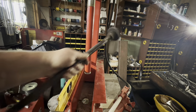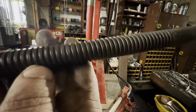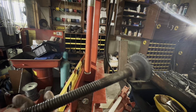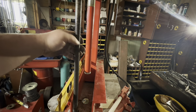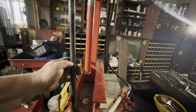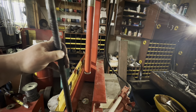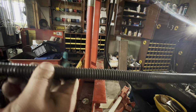It's very soft. I'm surprised as soft as it is, there's not more wear on these teeth. But it didn't take much at all. I do not like to use heat, especially when straightening threaded shafts, because there's a very, very high likelihood of distorting a couple teeth. Get yourself some lead - that's what I use. And wash your hands - don't put them in your mouth after you touch it. Very cool.